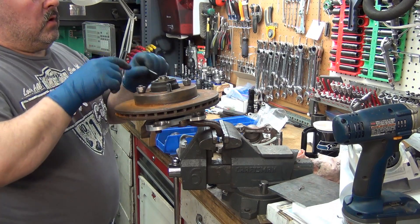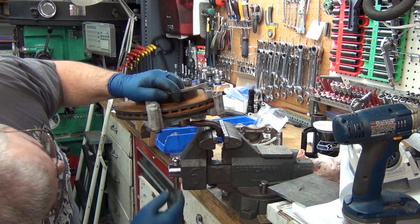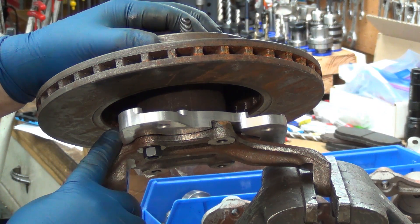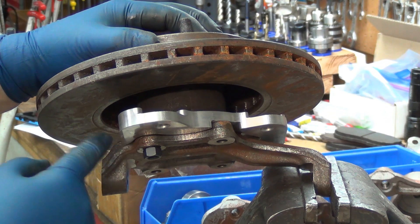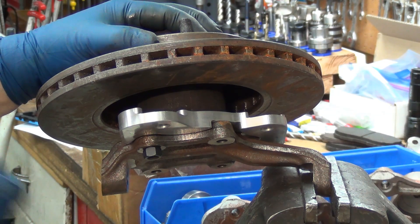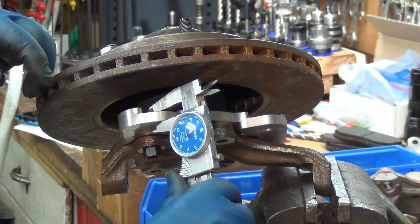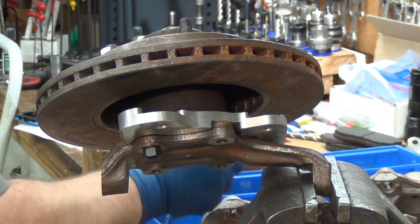That does work with the cotter pin — yeah, here too tight. The bottom is shortened here to clear the steering arm, so I'm kind of hoping the steering arm comes down and out far enough that it clears this. I don't really want to make this any thinner because I was using 3/8 plate before and that's what everything was set up for. It's still roughly 3/8 of an inch there, just a hair shy — that's fine.